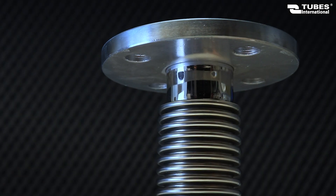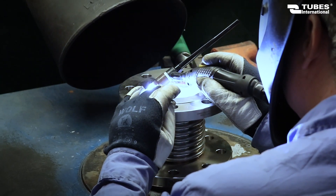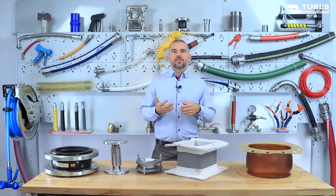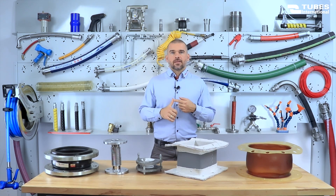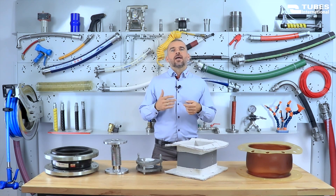Another type is steel expansion joints, which due to their multi-layer construction of thin stainless steel sheets, offer significantly greater flexibility than corrugated metal hoses. When should you opt for a steel expansion joint? For very high temperatures — the operating temperature range spans from minus 270 up to 550 degrees Celsius. When vacuum conditions are present, steel expansion joints provide greater stability. When the medium pressure exceeds the capabilities of rubber expansion joints, or in systems where impermeability to penetrating gases and fluids is required. Steel expansion joints absorb axial, lateral and angular movements, and are used in various industries including metallurgy, chemical processing and exhaust systems.